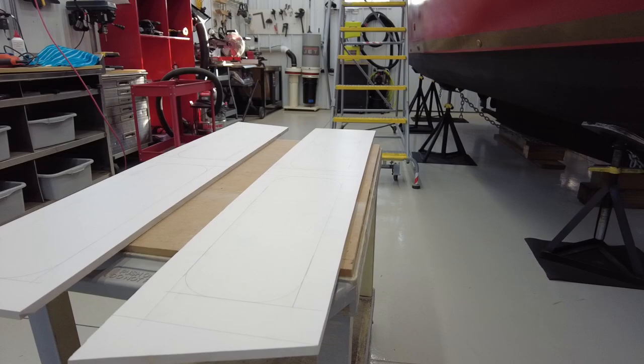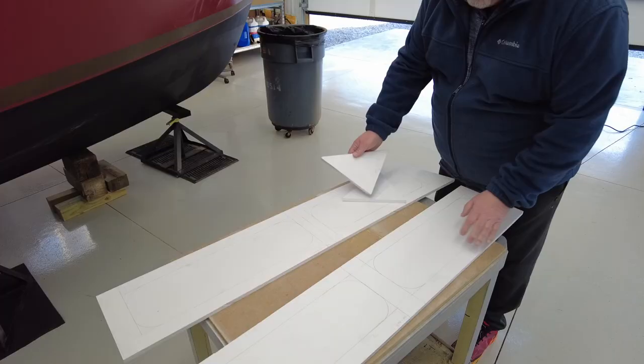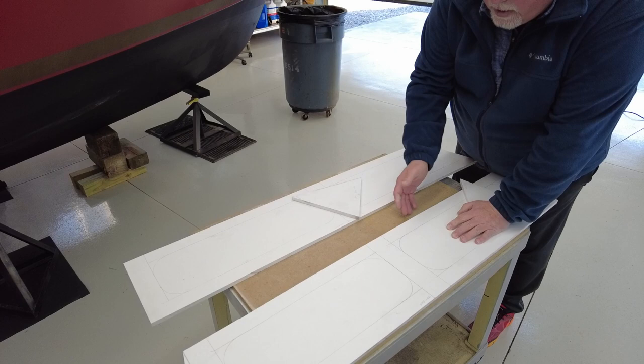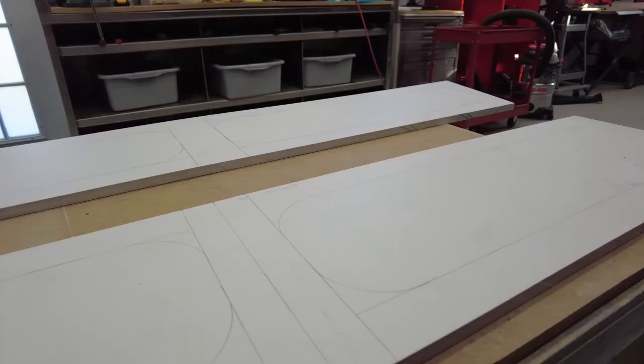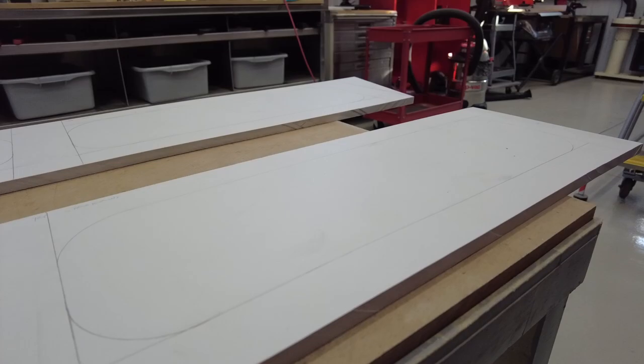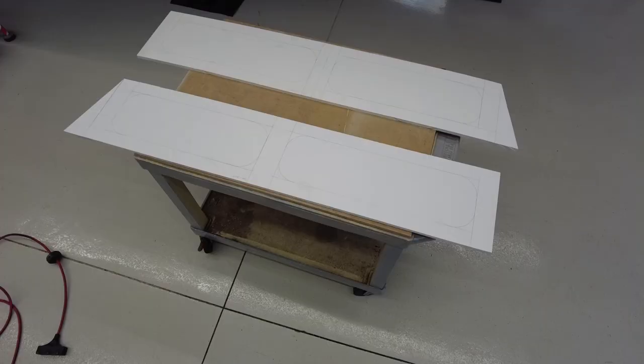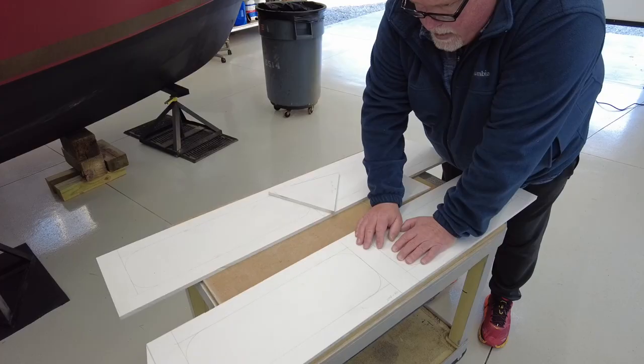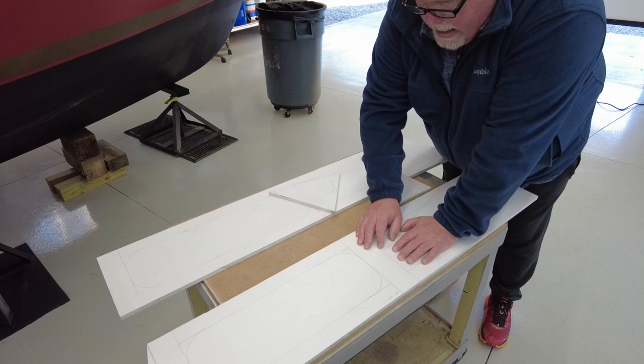The cabinet is a very simple construction. We've already cut out the pieces that'll make up each cabinet. Each cabinet is a side and a facing; the other side, bottom, and top are made by the contours of the hull of the boat. We already used our patterns that we made — we traced everything out, you can see the lines on here now. What we're going to be doing today is cutting with a jigsaw to cut out this oval here, then taking a router with a roundover bit to give a nice contour on these openings. After that, we'll use the screw and glue method and glue the pieces together, two per side, and they'll set overnight glued with epoxy.